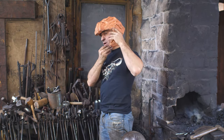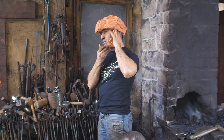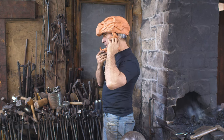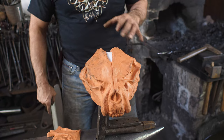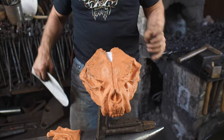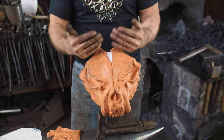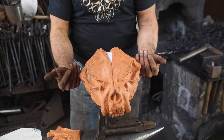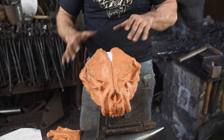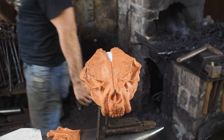And then the cheek plate here, which is the lower jaw section, goes in there somewhere like that. So we're gonna be doing this out of silicone bronze, and first what I need to do is get some templates. I've decided for the helmet portion here, I'm gonna do this in quadrants, four pieces. I'm trying to get a shape that I can still put onto my pitch board to do the details. Just hang on a second here.